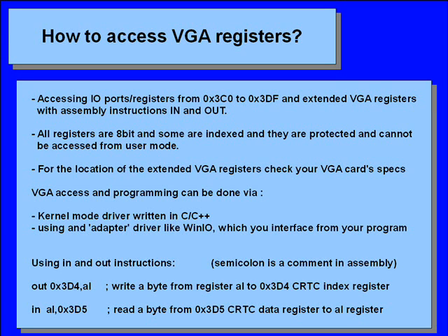Let's do an example of CRTC register access. First you need to write to the 0x3D4 index register the number of the index you wish to access, and then read or write the data register at 0x3D5. After this the index register resets back to 0x60, at least on my VGA. One more tip: it is not wise to write blindly to VGA registers. Read them first, set or clear bits, then write back.